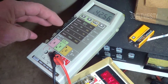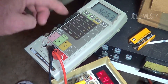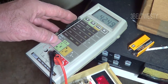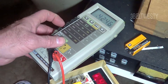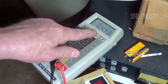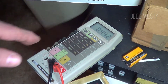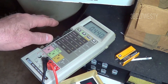You can have an 8060A that reads correctly on the 2 volt and 200 millivolt ranges, but then reads high on the higher three scales. It could be that one of the voltage dividers is faulty, or there's a wire-wound resistor in series that's gone bad. I was actually using this to measure voltage on a car and noticed it read high, then compared it against another voltmeter. So I need to open this up and see what the problem is.